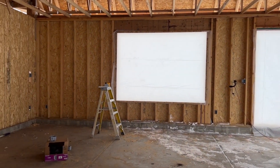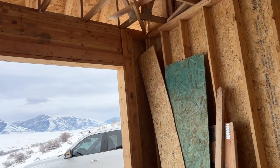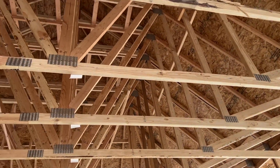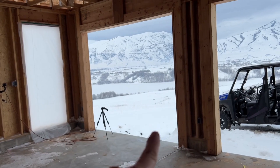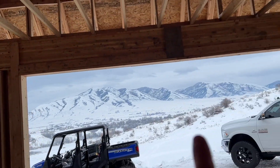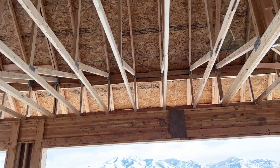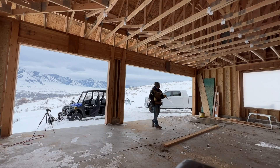The garage is completely laid out for outlet boxes, but there are two more I need to do — and they're the most important in a garage because your garage doors are powered by outlets. You need to put outlets in the ceiling for your garage door openers. The rule of thumb is: however high your garage opening is, your outlet needs to be two feet further back than that height from the center of the door. These are eight-foot doors, so I need to be 10 feet back. The blocks there tell me which truss line I need, which makes it really simple.